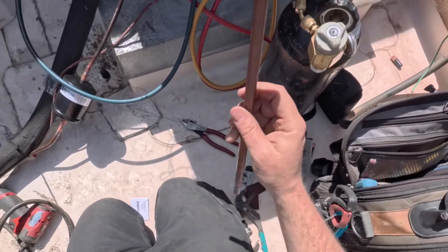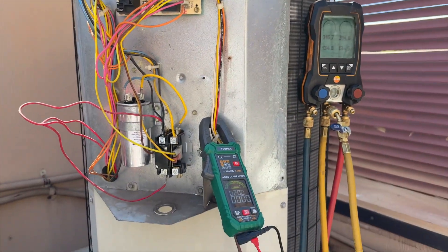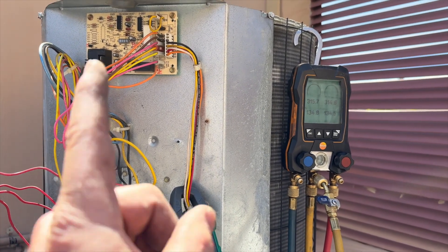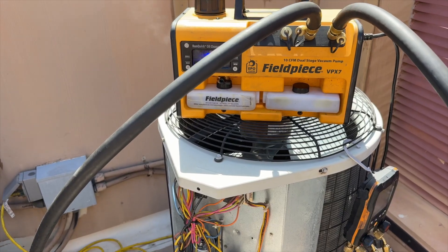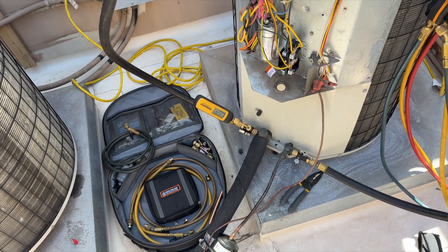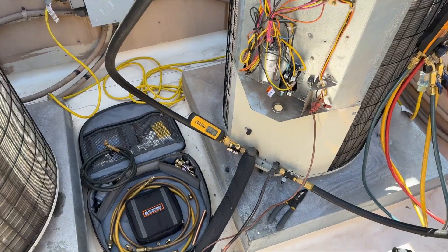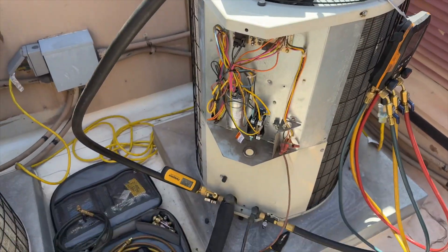In the meantime, I'll start cleaning up my mess. We're at 315.7 and 314.6 — it's been about 15 to 20 minutes. Everything seems to be good, so we're going to remove the nitrogen and then get the vacuum started. Vacuum pump is running — she's at 7,000, 6,000 microns. I'm going to get all this stuff back down, and by the time I'm done with that it should be done. I still haven't eaten lunch — I'm starving. We'll be back once the vacuum's done.